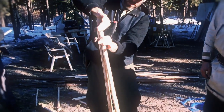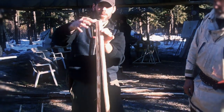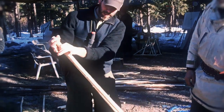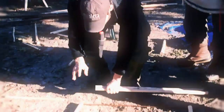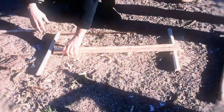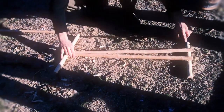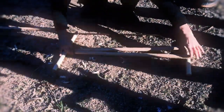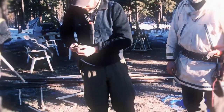The ideal situation is to have that contact all the way through. You don't want to hold this up and see the sky through it when you look through it. Then what we're going to do is use two constrictor knots — everyone remembers the constrictor knot. I'm going to bind that together at that point. Then there are two ways to do this: we can either create a flat point here where this butts up onto the frame, a flat point here and here, and then we use nails to hold it into place.